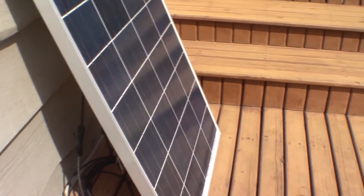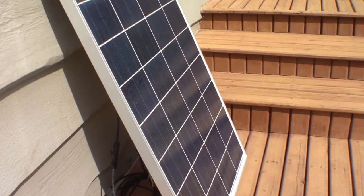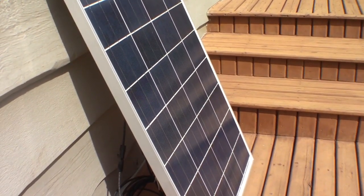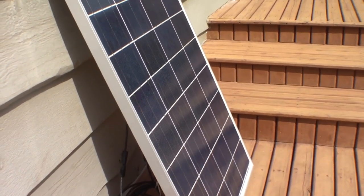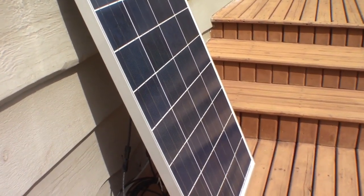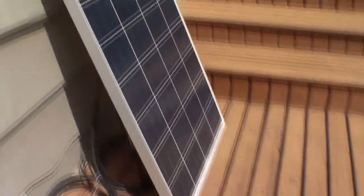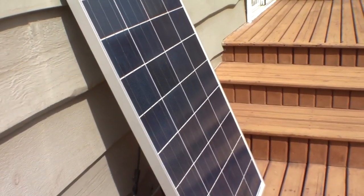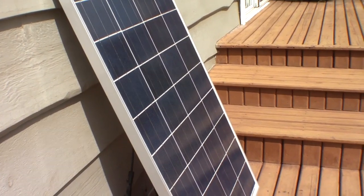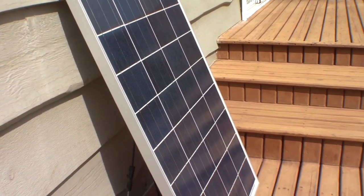It really does deliver in bright sunlight when you get over that 13.5 volts. You're looking at a 10 to 30 percent increase out of your panels. Add to that a solar tracking system — another 10 to 30 percent. So you can take a panel like that and on a good sunny day, by making sure it's always pointed directly at the sun and by pulse-charging at your maximum power point, you can increase the power output on average by at least 40 percent and up to 60 percent on a good sunny day.